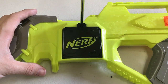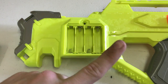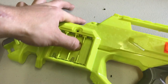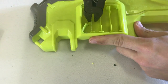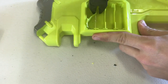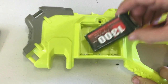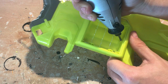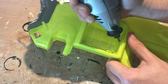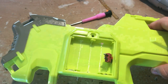For our bigger battery to fit, we need to make room in the battery tray. Rip out the battery connectors with some pliers and do the same with the walls — this saves us cutting up the shell with a Dremel and making a crazy mess. Unfortunately my battery still does not fit, but you get the idea. Dremel away a hole big enough to fit two wires to run through — this is where our LiPo connector will come through.